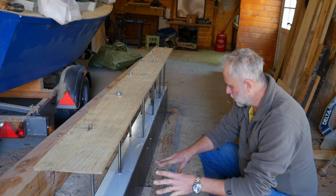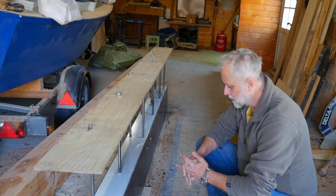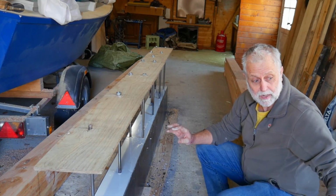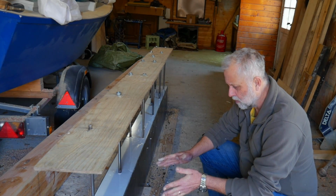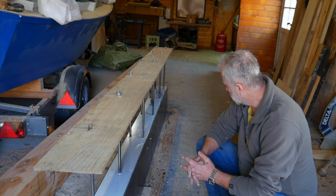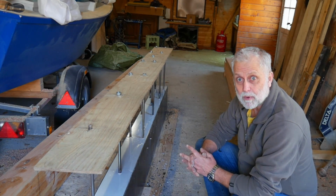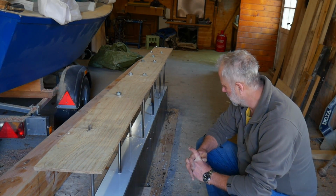The steel box weighed in at 100 kilos, which would have given me a total of 1400, but I've got a little bit of lead left over, about 50 kilos. So I've melted 1250 kilos of lead, plus 100 kilos for the box, 1350, which brings me nicely a bit over 5% overweight. I'm very, very pleased with that. Perfect, I think.